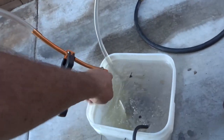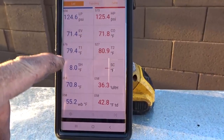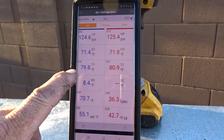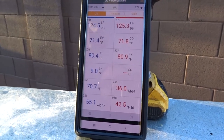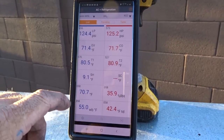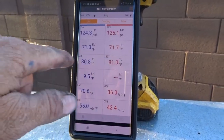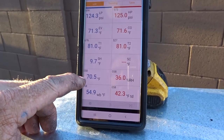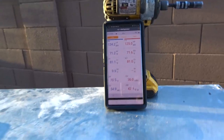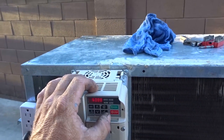Definitely moving a bit of water here. They are now equalizing about 80 degrees for the water, so water's already up to 80. Sun's going down. I'm not going to dump out the water and refill it to get it down to 70. Ignore superheat and sub-cooling. We're checking water in and out on the probes, not refrigerant. And we got 70 degrees, pretty much 71, for the air coming out.